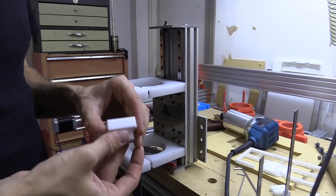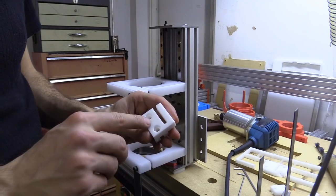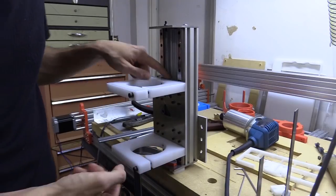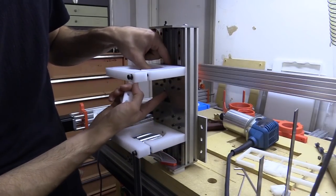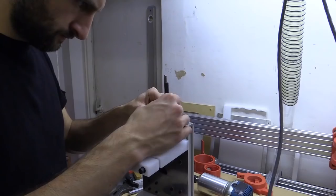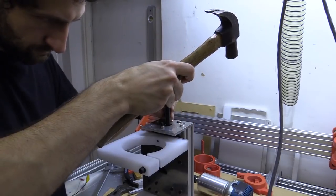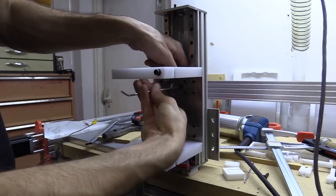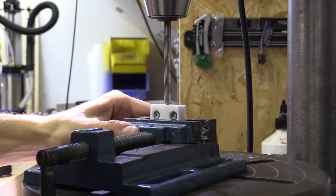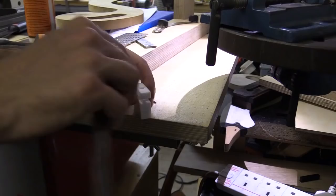So the last thing I need to do is to drill a hole through this nut block. I've actually fitted some on already and simply held it in place and put the machine screws through. What I need to do now is tap the nut block, so I've marked the center of the hole and where that lines up. I use a parallel punch held in the bearings at 90 degrees to the plate, knocking it with a hammer to make a mark on the blank nut block, and then drill a 7mm opening and use a TR8 tap that I made some time ago to make the thread.